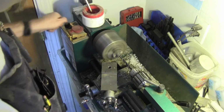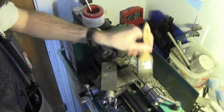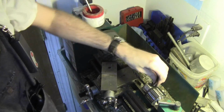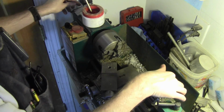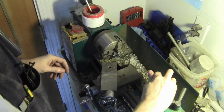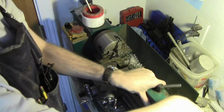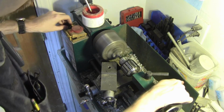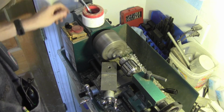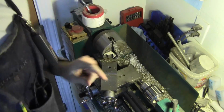Yeah, that's fine. Okay. Stick a countersink in this. Let's clean this up. And throw a countersink in there, so we can hang on to that bit. And we'll just chamfer that leading hole so that it'll tap nicely, and then I'll go get the tap. I wonder if I have a spiral 5/16. Needs a little bit of juice. That cut enough. Let's see. Oh yeah, plenty. That'll start a tap nicely. Alright, I'm going to go get a tap and I'll be right back.